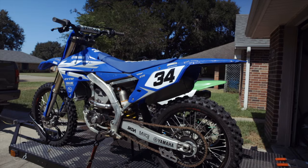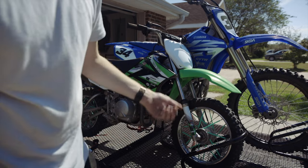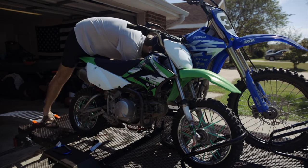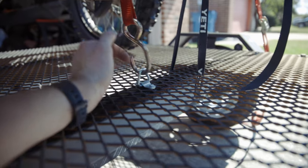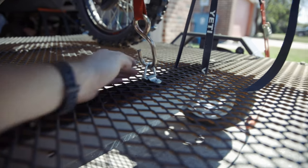I think that's pretty good, but I have nowhere to hook the strap on the other side. I have these little hooks that you can just bolt down to your trailer, so I'm going to install one on the inside right there where I can hook the strap. This hook bolts down to the frame and gives me an anchor point. It's rated for 1,200 pounds — the screws might not be, but definitely enough to hold this little bike down.